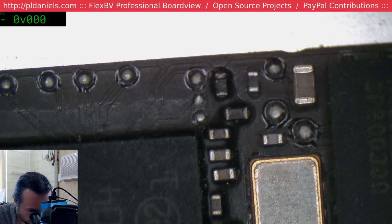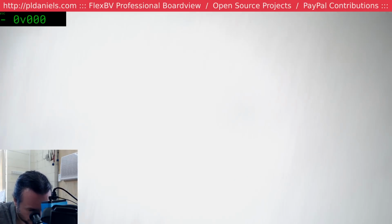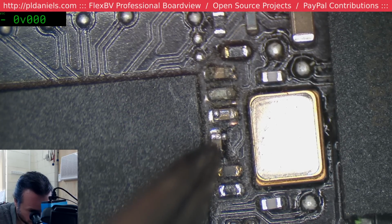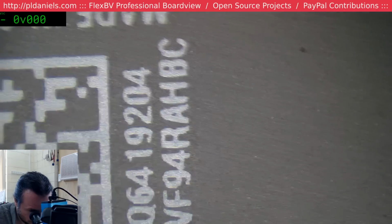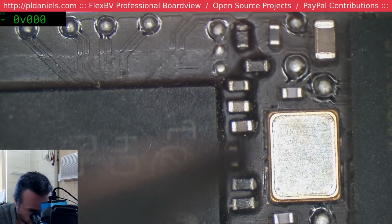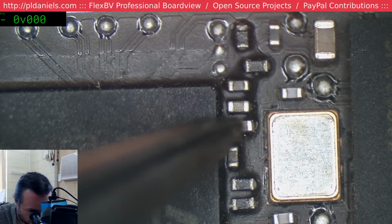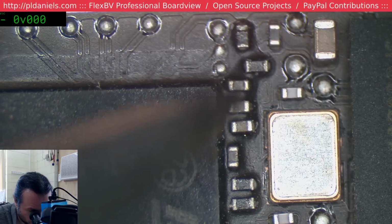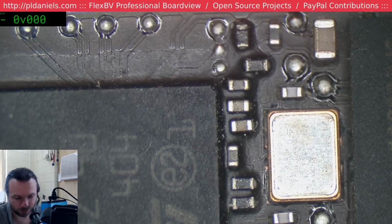Yeah, no schematics or board views for these things. This has to be reverse engineered. And like I said, it would have been real nice if they were all resistors, but they're not. So you've got one resistor, and the rest are... actually, that's a cap. That second one could be a filter. Damn it, keep losing my spot here. So that actually is a cap. Okay, so I've got 3 caps there. We could do something crazy, like given the size of them and everything like that, I could estimate and just drop in 100 nanofarad, 50 volt decoupling caps.